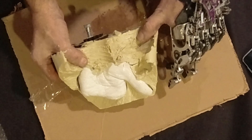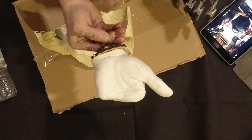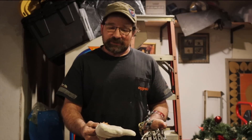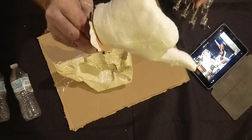This is why you want to demold pretty soon after it starts going off, because otherwise it'll inhibit the plaster from fully setting up. That looks like a great cast. Something that I glossed over in the last video was the inclusion of a 3/8 lag bolt inserted into the base of the plaster. I did this so I had an easy way to hold and fixture the plaster as I was cleaning and then later sealing it.